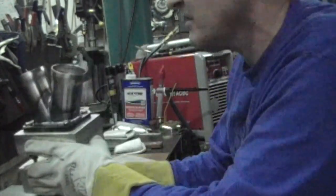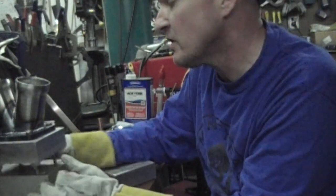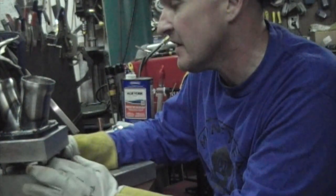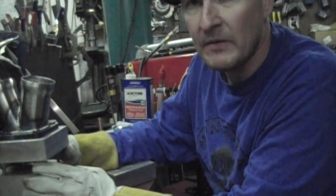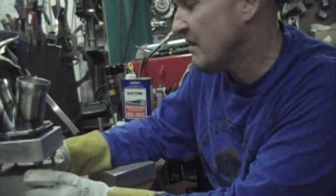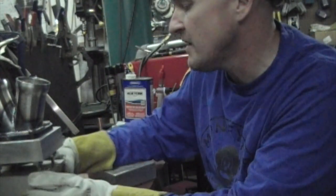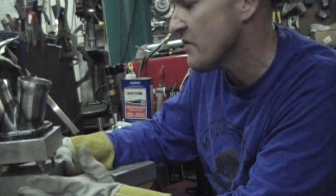We're just going to let it sit and cool for a while. Once it's done cooling, we're going to break that collector off there. I'll run the back of it on the belt sander, go on the inside of those ports and port it out a little bit with a die grinder, and clean up with the sanding disc, and that'll be it. It'll be ready to go. So next time you see it, it'll be pretty much all done. I don't think you need to see any of that stuff, so I'll just show you the finished product.